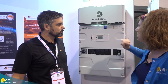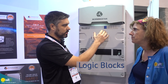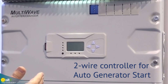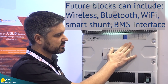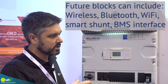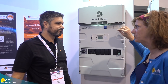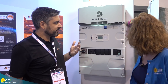Up here we've reserved a DIN rail behind the faceplate for what we're calling BOS blocks or logic blocks that will add functionality to the product over time. At launch, we'll include a two-wire dry contact GenStart module — an all-purpose module for controlling an external device or starting and stopping a simple genset. In the future, this will expand to include wireless interfaces like Bluetooth or 802.11 Wi-Fi, a smart shunt interface to look at total current through the system, more advanced generator control modules, and potentially a lithium-ion BMS interface. It's very modular, so you can buy only the components you need. Morningstar has always felt we should never force anyone to buy things they don't need.